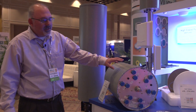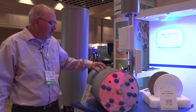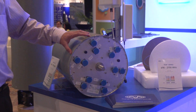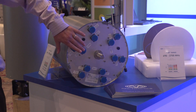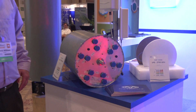For other markets that prefer the tri-sector application, this is our new 5622 antenna, which is a 1424 all-band form factor. In the tri-sector configuration, we have four connectors per sector — two connectors for low band, two for high band — and then three sectors of those.